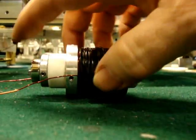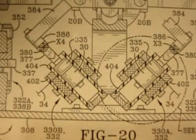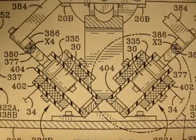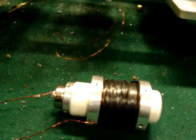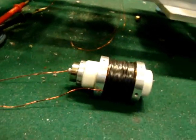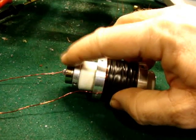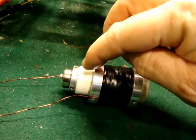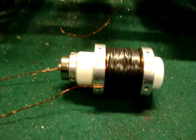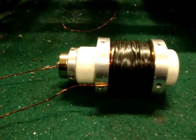So what happens is these magnets are going to cancel that out. That's one of the patent pending things that I got here in my invention. Here's one of the pages and I got quite a few pages. But as it goes down inside there it's going to cancel it out. When it hits these magnets down in here it's only going to come so far, but it's got to be tuned right — to the right distance — because if you go too far it's just not going to work. If this distance is too close, as it comes in it's going to slam into it. So you've got to have that distance perfect from this coil when it enters to where it's going to push it out.